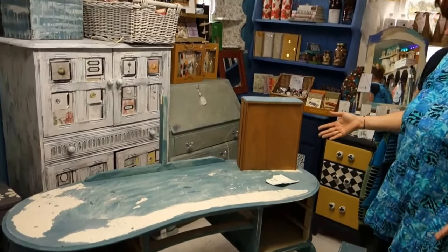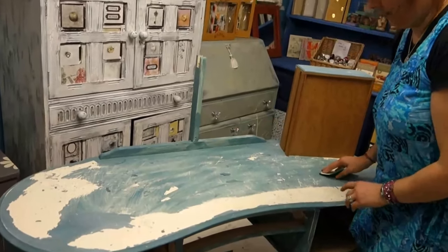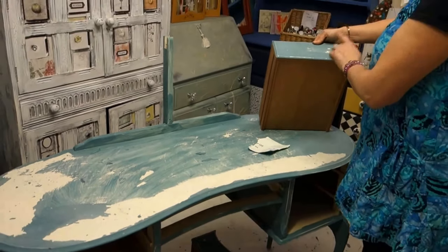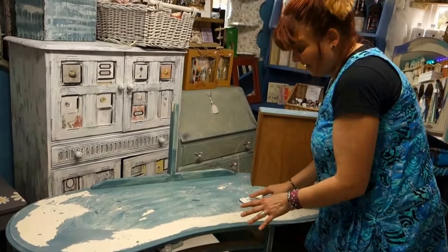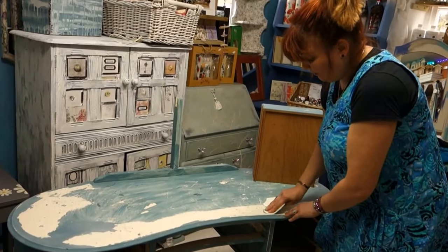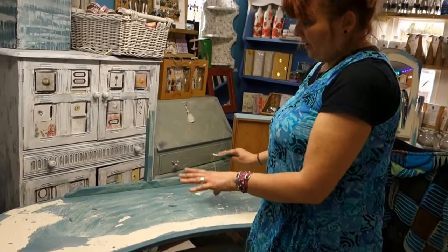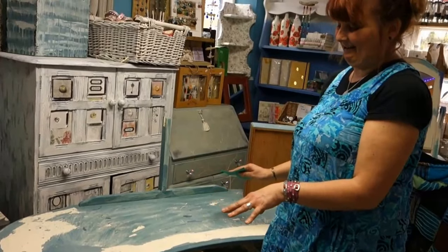We've had a little bit of a disaster frankly. I painted two layers and as it was drying we noticed huge bits of it were peeling off — particularly on the top, not so much on the drawers. The drawers are quite good, more what I was expecting in terms of a chippy look. We cleaned the top in exactly the same way as the rest, but the surface was quite shiny. So we've gone over it with sandpaper, got rid of all the obvious loose bits, given it a gentle sand everywhere, and we're going to go over it with some white — which I intended to do anyway — and see if that holds and if the key helps. Hopefully no more disasters.